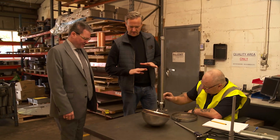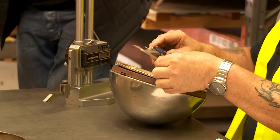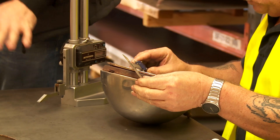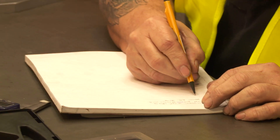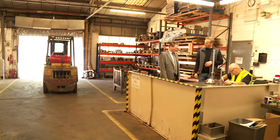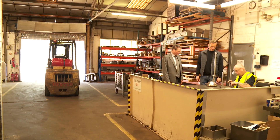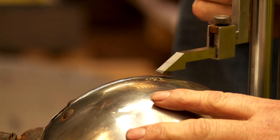So this is an engineering table, isn't it? This is a calibrated table. The surface is measured to microns all over — absolutely flat. It has to be a perfect datum to take all the measurements from using instruments like that. Do you always go for external measurements or do you ever go internal? Both. All the measurements we can get, the more information, the more accurate the component will be.